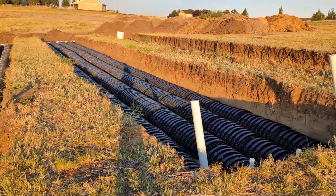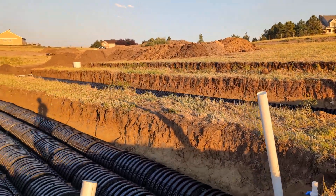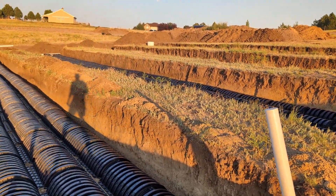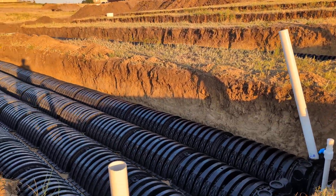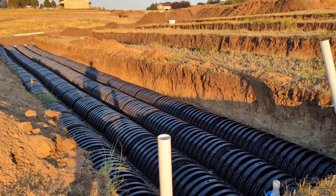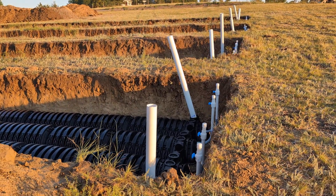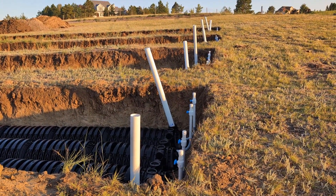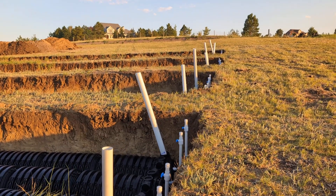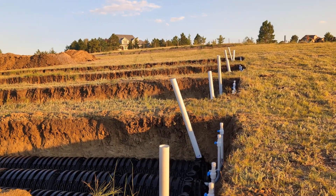This is a big job with a lot of digging and piles of dirt everywhere. We took it a layer at a time — as it got hard to dig we'd only go a few inches at a time, using the excavator with a laser to cut a level layer off and scoop it out. From this angle you can see the 14% grade — the beds are stair-stepped down, each about 13 inches lower than the one above it.